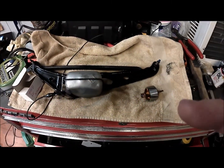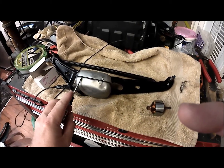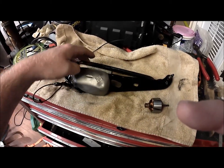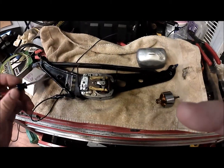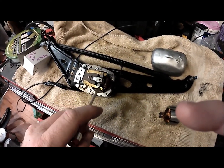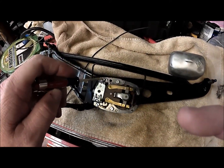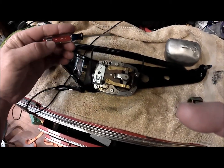Let's get started. You take a little straight screwdriver and flip the little clip off, just like you do on your valve cover. Take off the top cover and put that to the side. Here's your armature right here. It has this little apparatus where the brush sits. And it has two bolts, one there and one here, that hold the whole assembly on.